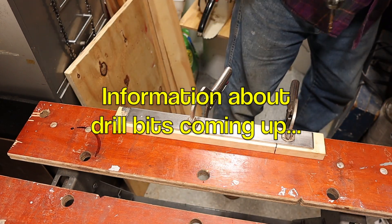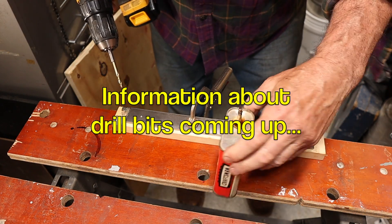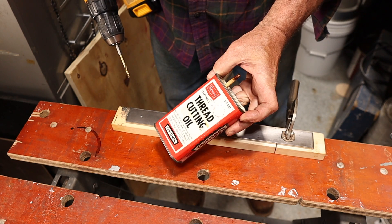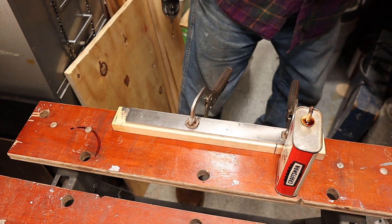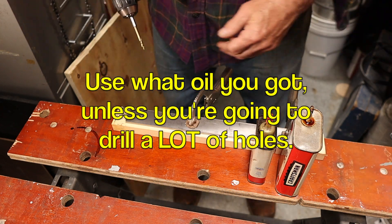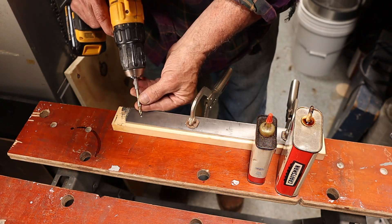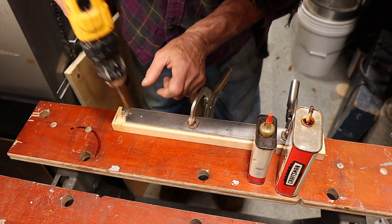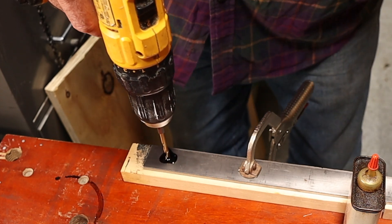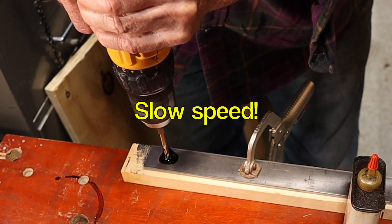What I'm going to do here is drill a small hole first. This is a 3/16 inch bit - I want to end up with a half inch, but I'm going to start with a small bit first, and I'm going to use thread cutting oil. I could just as easily use regular handy oil, or according to the 1945 book, you can use lard as a cutting lubricant. I'm going to put a little bit of cutting oil on and start slow. We're going to keep the RPMs low.